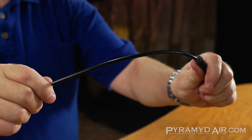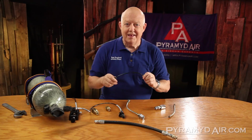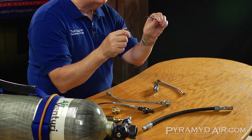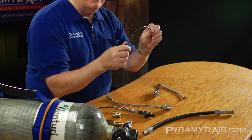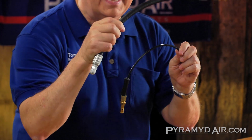There's a little hose. It's so little the hole that goes through it is also little. We call it a micro bore. Because the hole through the hose is small, even though there's a lot of pressure, the hose material doesn't have to be as thick as it is on this big guy. Also, for you pump users, when you get done and you bleed your hose and you're using a micro bore, you lose less air. You can put the same pressure through a micro bore hose and it flows very fast. You don't have to worry about that.